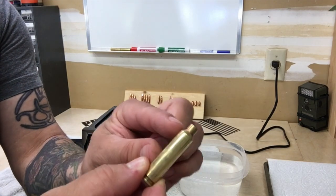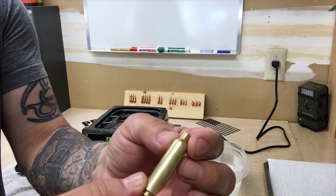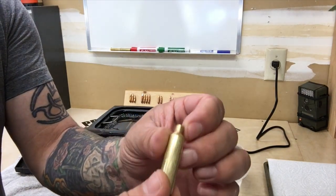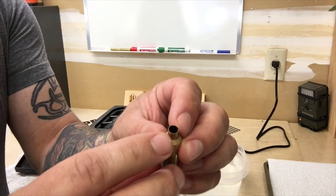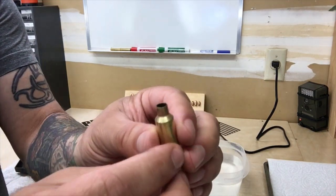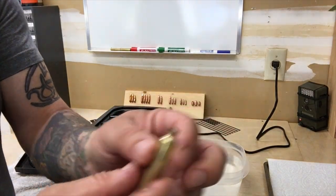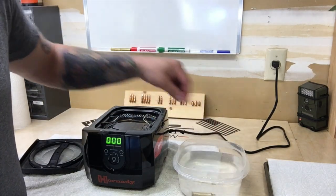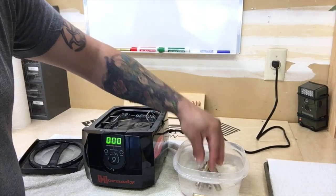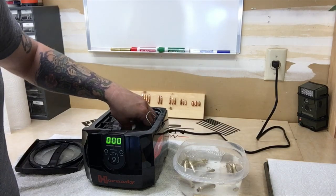Dry this off a little bit so we can get a good look at it. There is the clean brass. Now, it looks a little bit discolored up here — the reason for that is because this is Lapua brass. They do such a great job annealing it that it leaves it just kind of an off color. But it's quite clean. It's going to be really hard, if not impossible, for you guys to see inside the neck, but I can see it and it is quite nice and clean. Next step: into some nice lukewarm water for a good rinse, into the house, under the sink, to finish off that rinse.